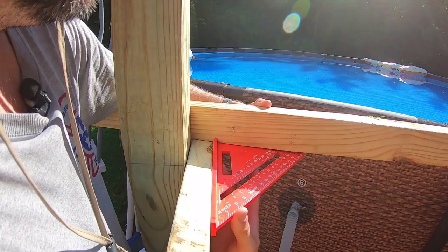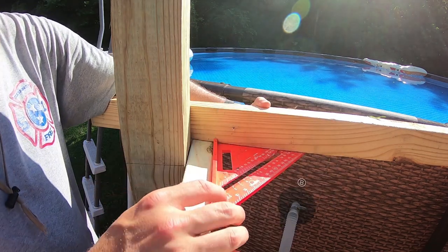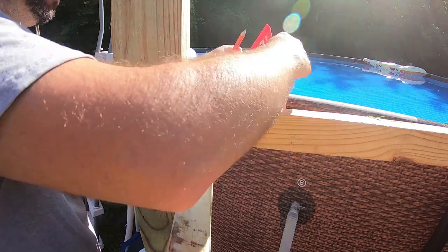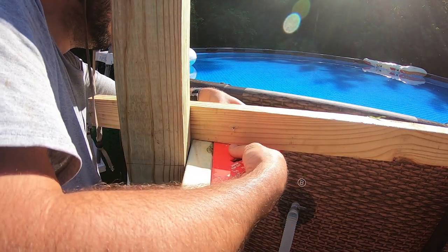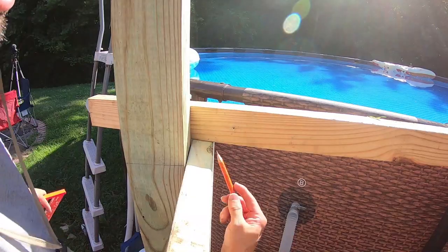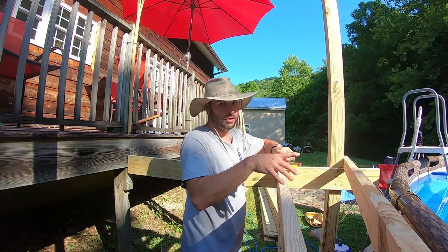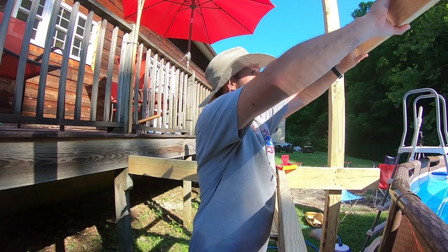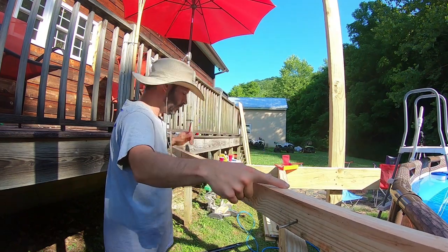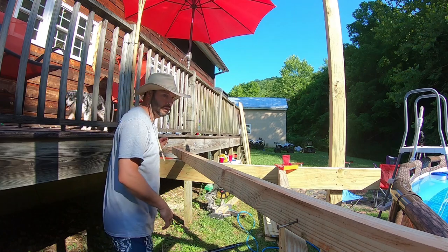Take and slide that right up there into that crevice. You can see we've got 65, 70, 75 — so it should be about a 75-degree angle from 90. Yep, 15. Go ahead and mark that there. So this is not the board we're going to be using. We're going to use another 2x6 and use this as a template, so we can measure from this point to that point and see how far along that is.